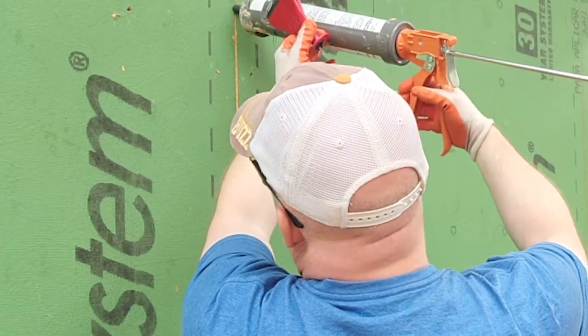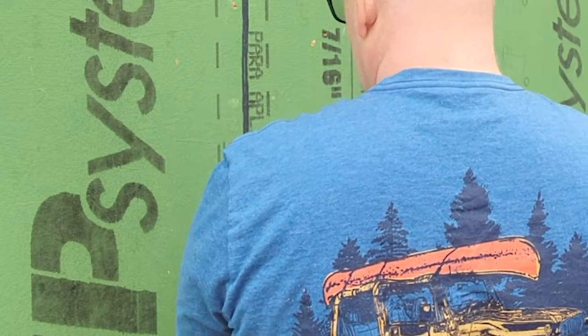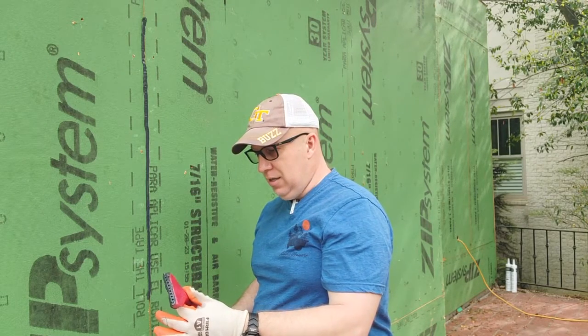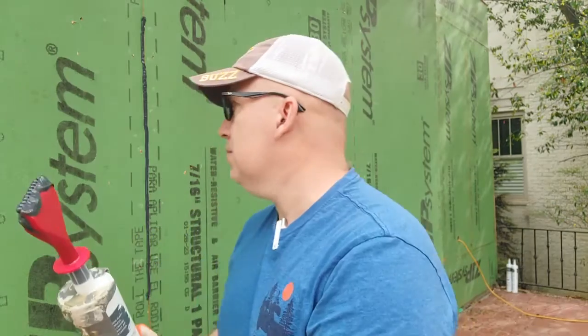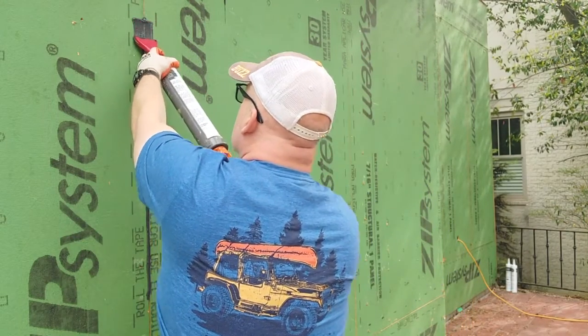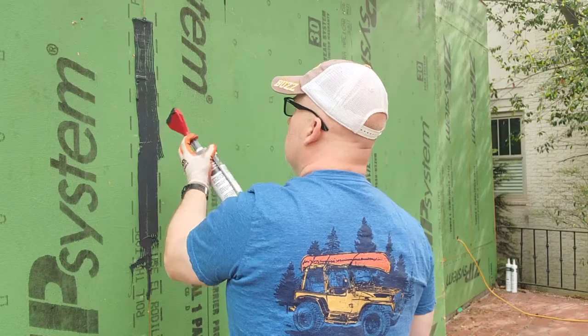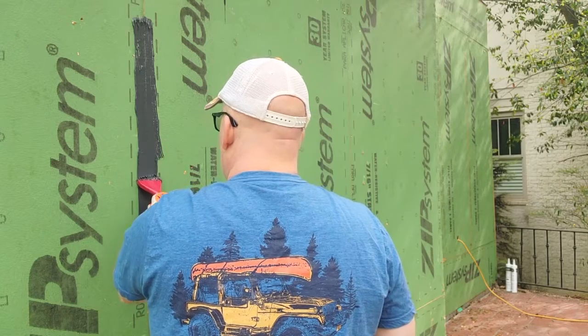The first thing I'm going to do is add just a little bit to the actual seam itself. The reason is we want this to get into the crack, but not too much on the outsides. Now put the applicator on — as you can see, you've got these little holes, little grooves in here. I found this in the flooring department at Home Depot; it's used for putting adhesive down. I'm going to squirt it in on one side, then take the other side and spread it out. You can see it's still got some little grooves, so I'm going to take the back side of it and spread it out.